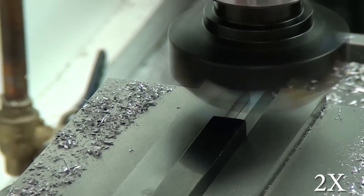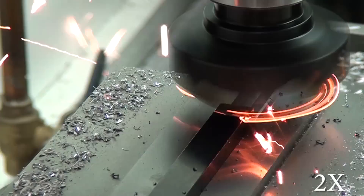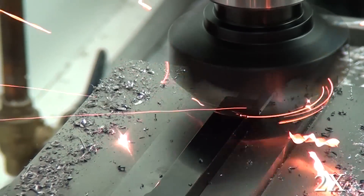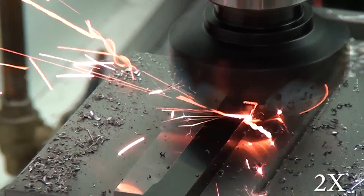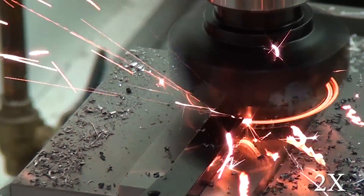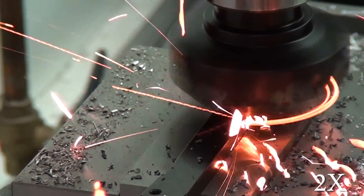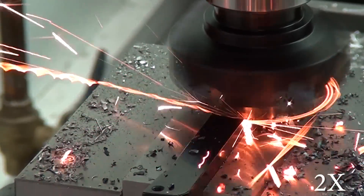Not the overall process, because it's worked fantastically, but while I was machining, I neglected to pay attention to what I was doing and I nearly ruined the tool. I was able to save it luckily, but I'll show you what happened. Basically, I was trying to take a ten thousandths depth of cut and I was shocked right away at how hard the steel was, with sparks and super hot black chips coming off of it.